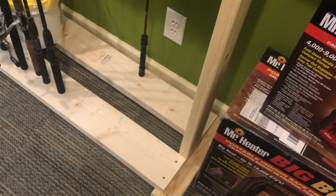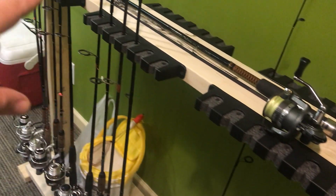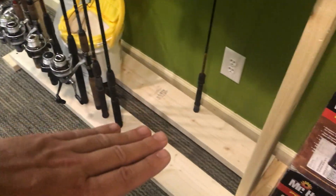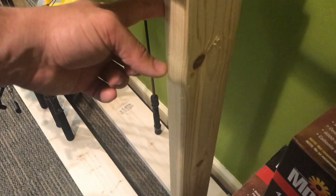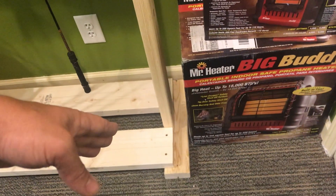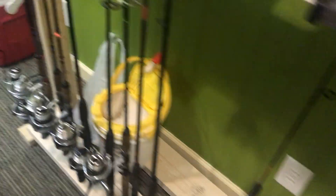We'll start with the main frame. What I'm talking about is: foot, upright, crossbeam — and then obviously upright, foot on the other side. The simplest way to do this so it's even and you can use it both sides, like a platform like I did, is: you take your 36-inch 2x4, then take your 16-inch 2x4 and center it right there in the middle, up against the inside of the 2x4. Obviously it's not the inside until you do the second one — you just have to remember to face them both towards each other.